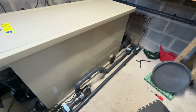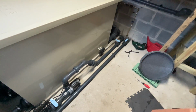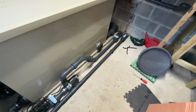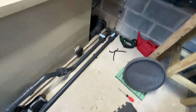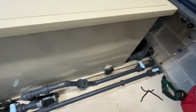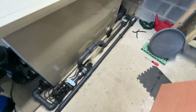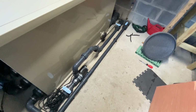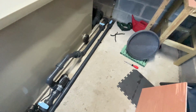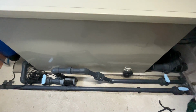Now, having said that, it's the back part of the pond they don't use in the winter. I shut it down in the winter, so in the next couple of weeks or so it'll be shut down. But what I can do is, if the worst comes to the worst, you can actually open it up and take the internals out, and it'll just flow straight through like an ordinary pipe. Means I just won't have a non-return valve.